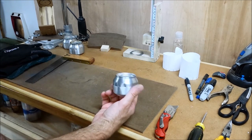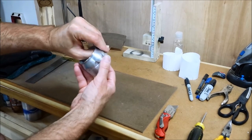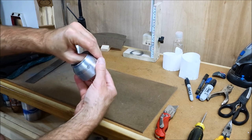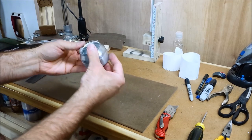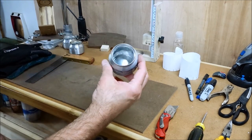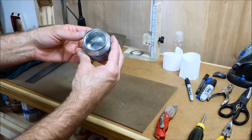The counterintuitive step, reach in with your thumb and flatten out those 8 creases now that you just made. This stove works on capillary action. The alcohol is going to capillary its way up where those creases are or were. So the less space, the better the capillary action works. And you can see how those skirts now, the slits, allow the base of that inside of the stove go clear down into the groove in the bottom.